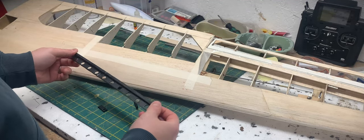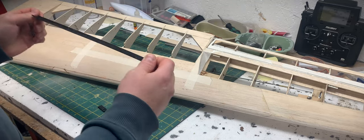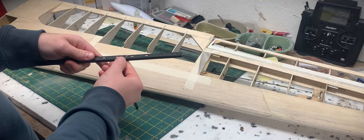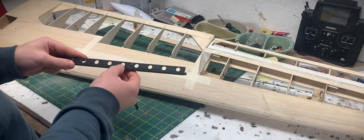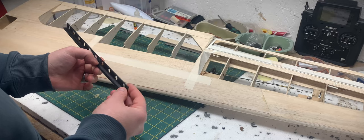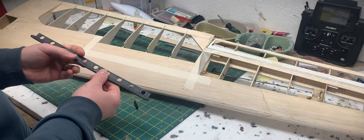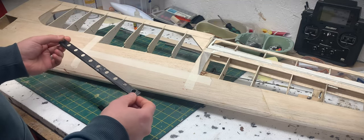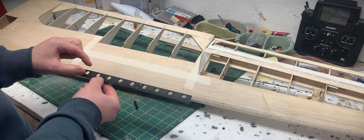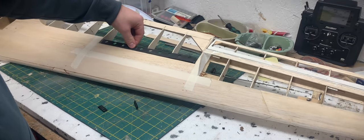This is the first version of my wing spoiler — the 3D printer is already working on version 2. The two parts have been joined together but I failed to get them straight. The dowel and tongue didn't really work; printing at that sort of one-millimetre depth didn't work out. So I'm going to cut those off the next version and just have a flat mating surface with some epoxy. I've increased the depth up to 30mm and it fits quite nicely in the gap.